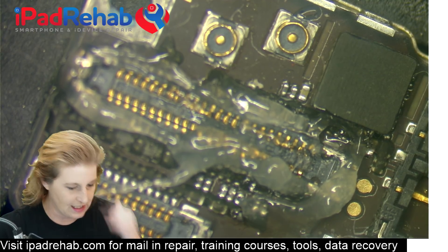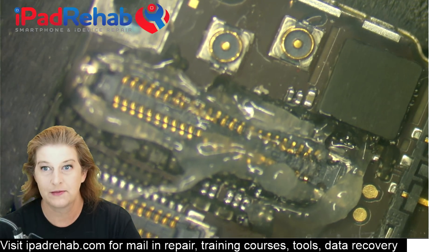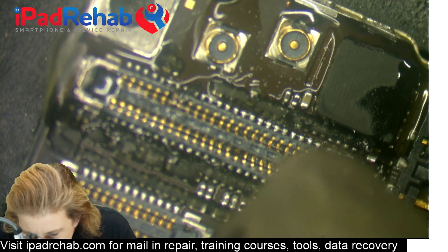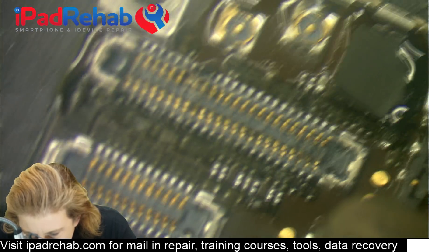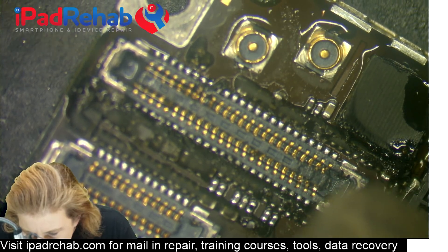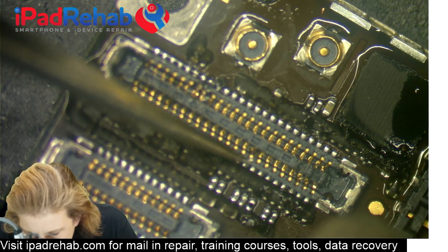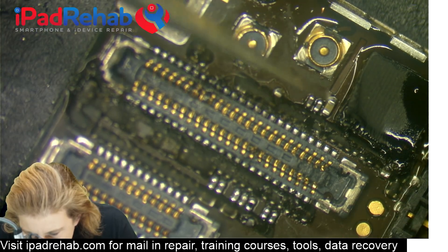My setup will change — in fact I'm 10 degrees higher than I was a month ago, just because I've had to adjust as the heating element ages and as the shape of the nozzle changes. The key to not pulling pads is making sure that I have movement on every pin before I attempt to take the connector off.